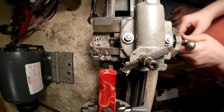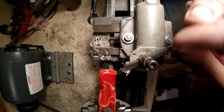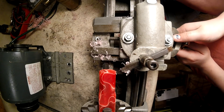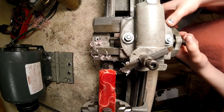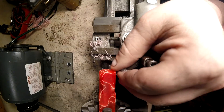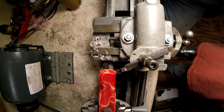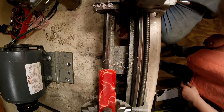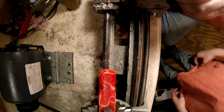So I think that's all for today. We got the compound turned sideways because we had the camera mounted on it earlier, so we'll get the proper T-nuts — we got some more things to do. But you actually got to run your lathe. Let's put the tail stock right here out of the way, lock it down. Now what you have to do — I think we're turned too far. Where's the Allen wrench? If it's a T-nut, if it's a lantern style — so unlock your hand nut. Let's pull the carriage back out of the way. I want to bring it back around so you'd have an angle on there that would allow you to do the facing. Let's see how that looks.